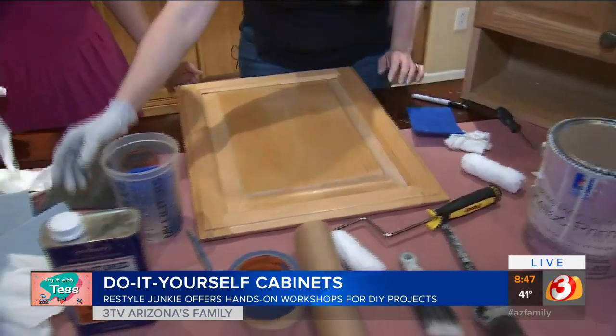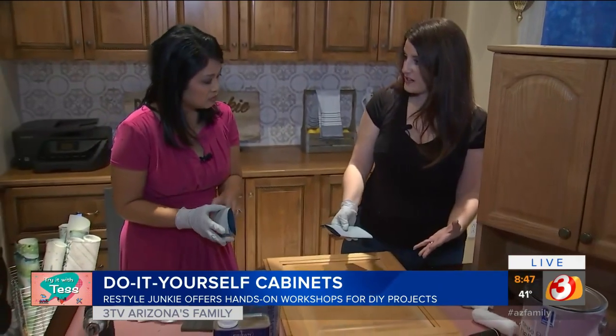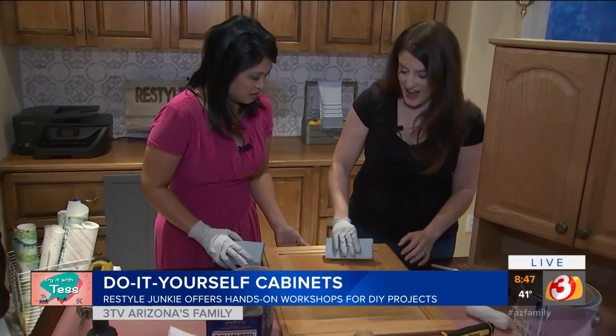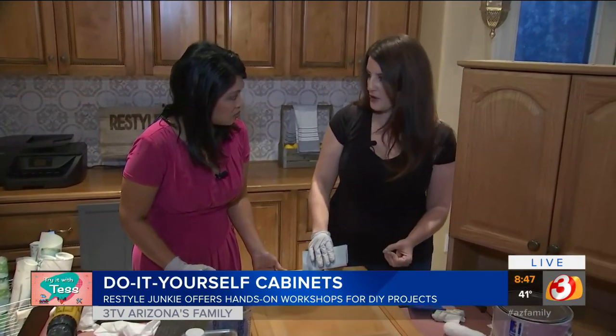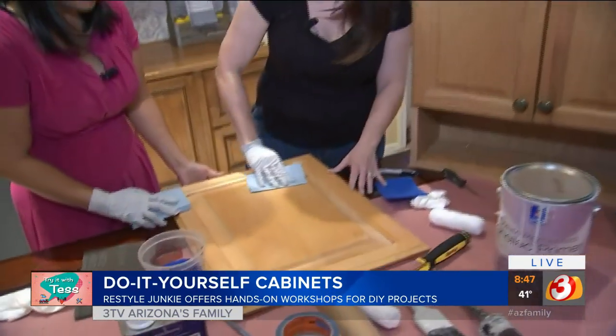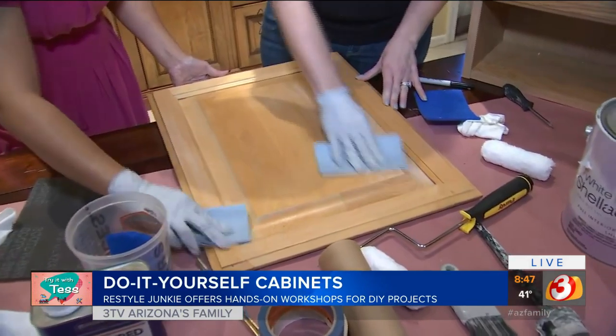Okay. So then the next step, we wipe that off, and you always want to sand with the grain. You can use an electric sander. Just be gentle with it. It knows what to do. It doesn't need you to push it. And I always say that you should be bored before your arm is tired. Oh, okay. Because you're not going to put that much into it. So you don't want to push hard. You don't really need to. We're just going up and down? Yeah, we're just going to go up and down.